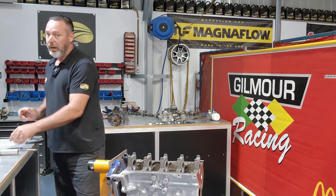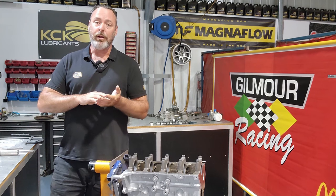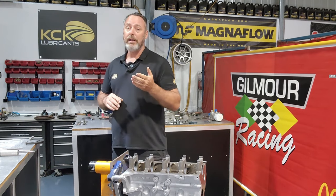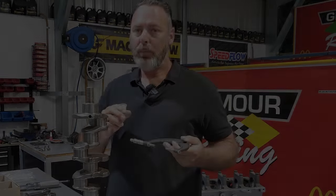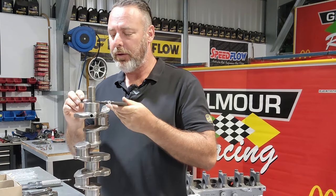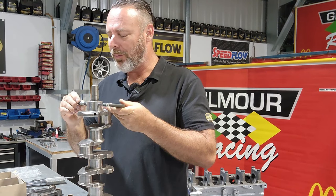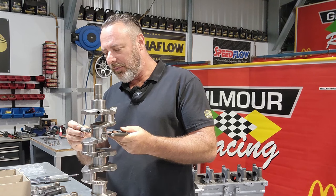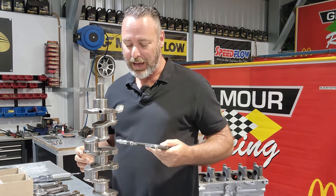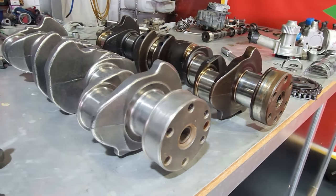Now I can go over to the crankshaft and measure it, and that tells me exactly what I've got. Since I'm measuring everything with the same equipment, any discrepancies between internal and external measurements are eliminated. Measuring the journal is all about feel - just finding that sweet spot where it just contacts without recalibrating the micrometers. You've probably noticed this isn't the crankshaft the engine originally came with - that crankshaft has a twist in it that we would unlikely be able to machine out.